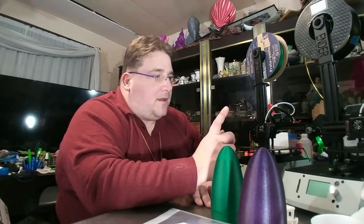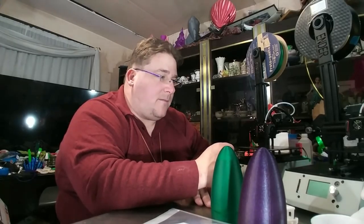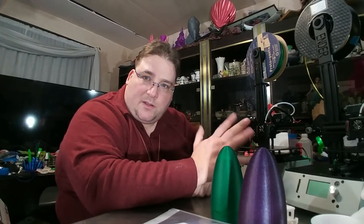But, suggestions. Shorten that bottom tube. Knock 4 inches off it, 3 or 4 inches. Use your best judgment. Glue stick on the hotbed. It helps a lot. It really does. And every now and then, wipe it down and reapply. You can print fast. My standard speed for this printer is 80 millimeters a second for a maximum default print speed, with an underspeed for outer layer of 90% or 80%, depending on what kind of quality I want. And infill, I run it at 100%.